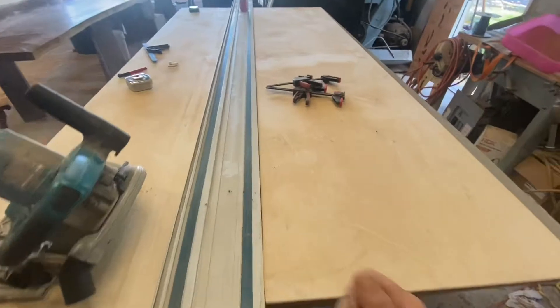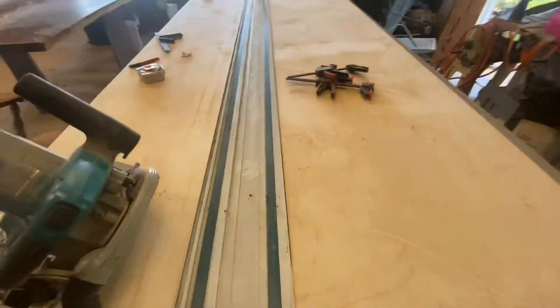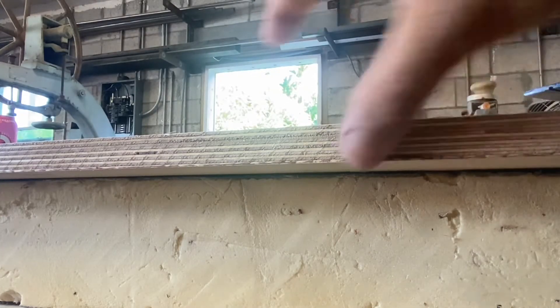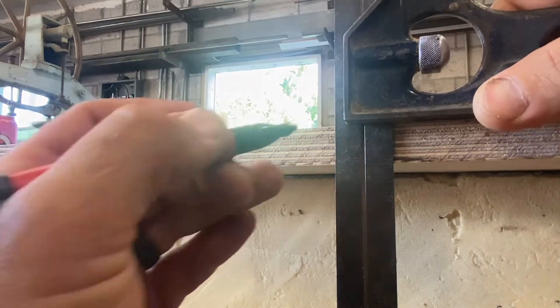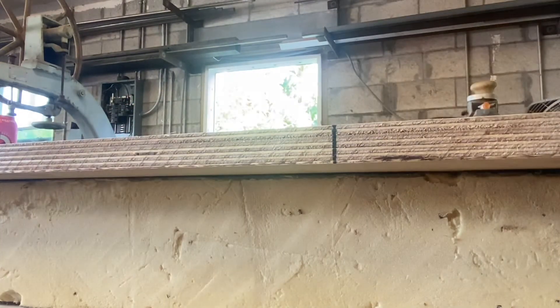So what we've got to do is cheat over a little bit to compensate for that 45 degree bevel, and I'm going to show you how to figure that out. Here we are on the edge of the piece of plywood — a three quarter inch thick piece of 13-ply Baltic birch. Very nice piece of wood. The first thing we're going to do is lay out where we think our center mark would be. I'm going to use a Sharpie just so you guys can see a little bit better. Let's call that our center line.